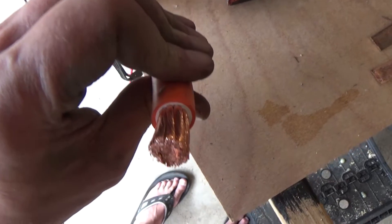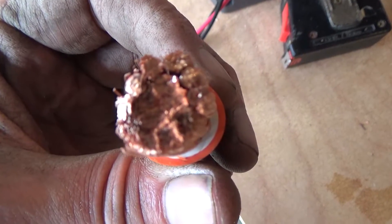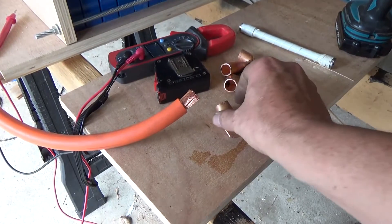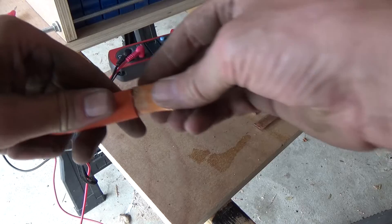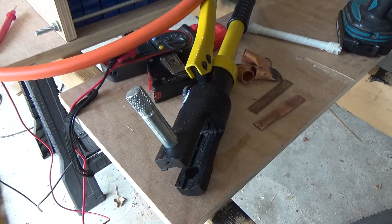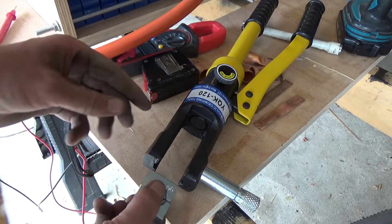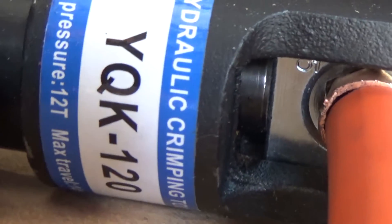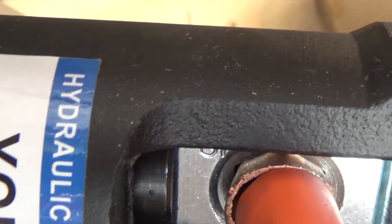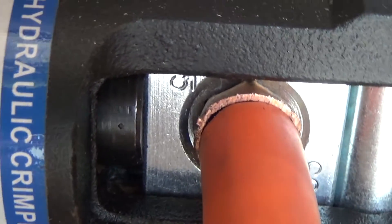This is a beautiful cable. It's a welding cable so it's quite hard wearing, very very flexible — 95mm squared and about a zillion strands. So the plan here is to crimp this lug onto this cable like so. I have my 95 crimping anvils and then this is a hydraulic crimper so as I pump the handle there's a little ram that comes out and presses these two anvils together.